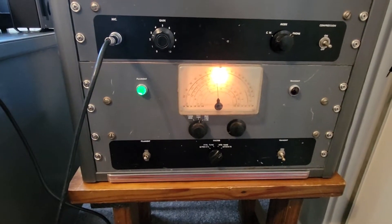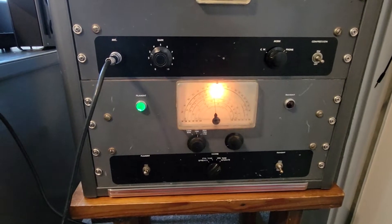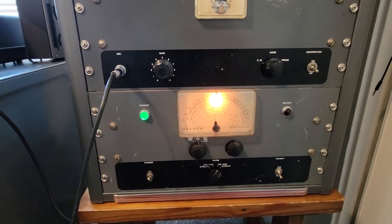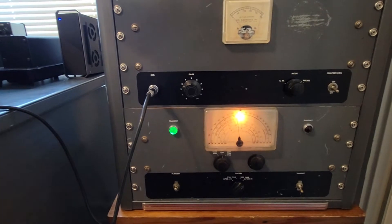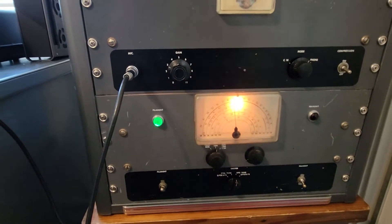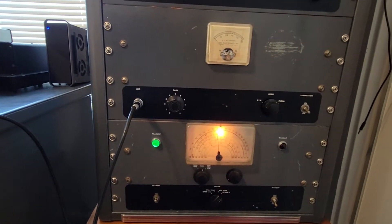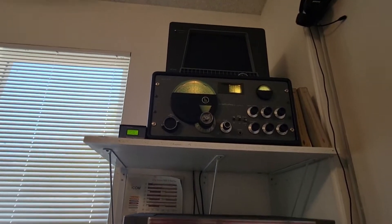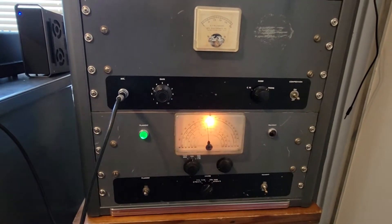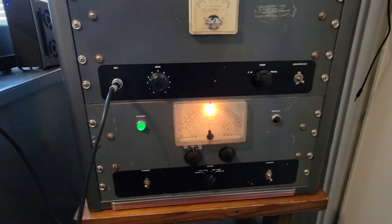You've got the exciter switch down here — operate on either side — and VFO tune. If you were using a crystal, you would flip the switch all the way over to this operate, then go one position up to crystal tune. But we are using the VFO. So if you flip this switch, the whole exciter section is keyed up now. That's how you key up the exciter for either spot tuning to your receiver or to tune the exciter section, which is the first part of all of this.